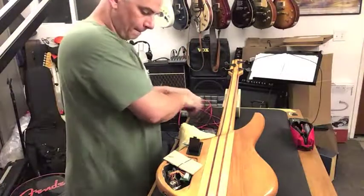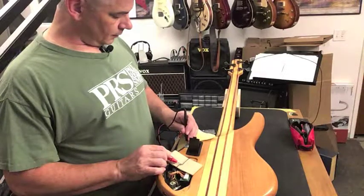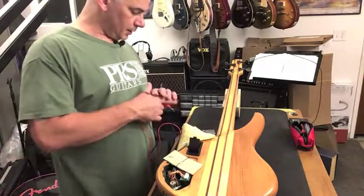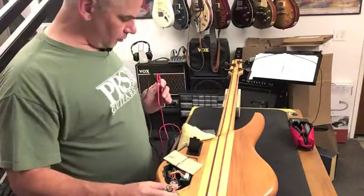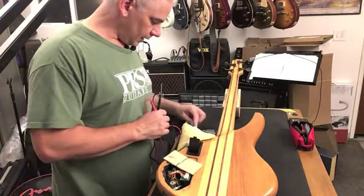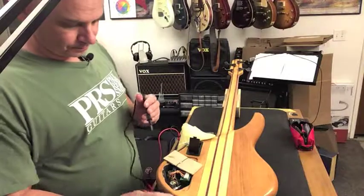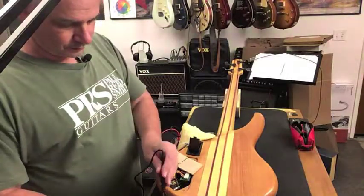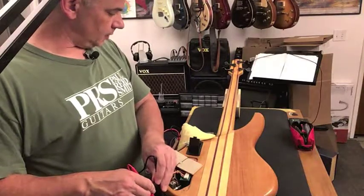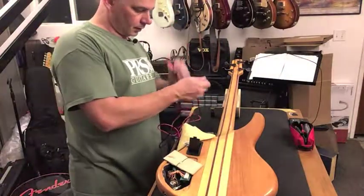We have continuity — I'll show you the beep here. We've got about one ohm, so the wire is good. I did a little more inspecting and also checked the red wire in the battery compartment — that seems to be good. So we seem to have two problems. When we check our battery, it's reading 2.7 volts. And then there's the other issue I will show you.